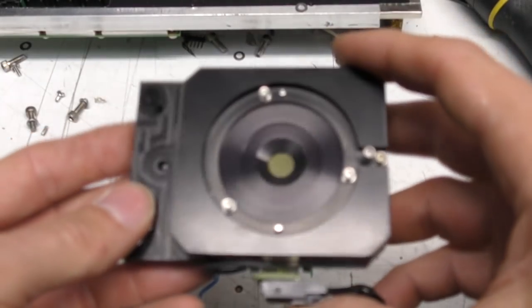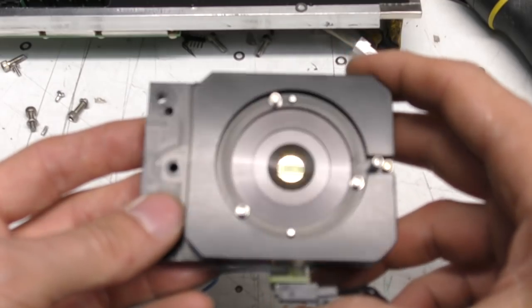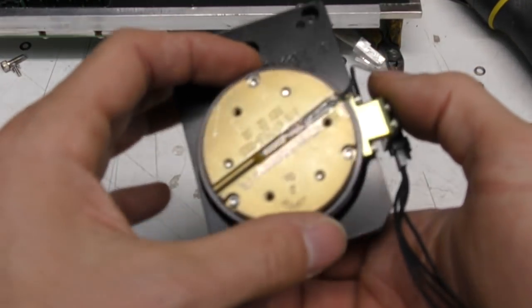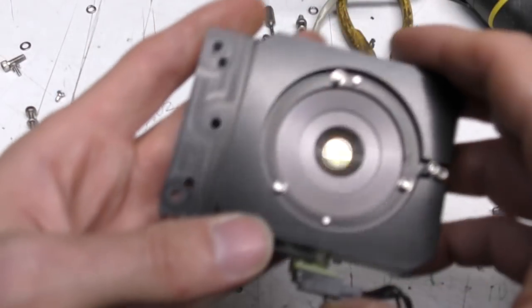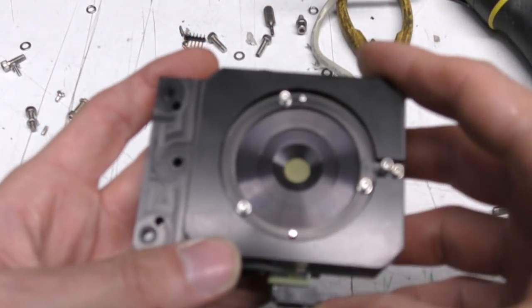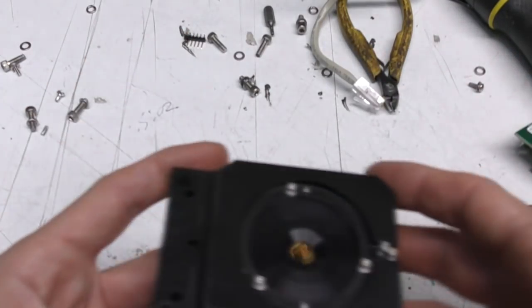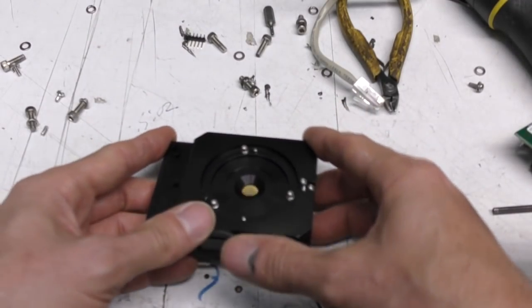So let's take a look at this adaptive optics thingy. It's a bit reminiscent of a speaker, but I suspect it's more complex than that. I think it has some sort of positional feedback, as the connectors on the board had drive and sense marked on them. It's got 4 pins. The main actuator is 8 ohms, so again pretty similar to a speaker.